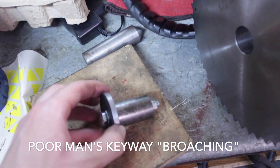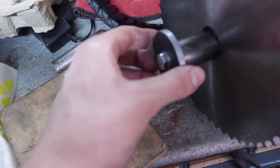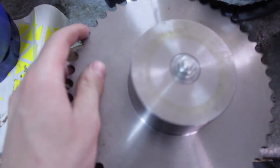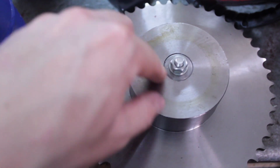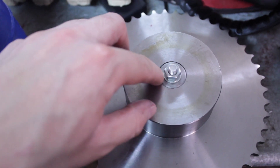I made this piece on the lathe and I'm going to put it here, tag weld here, and then put it in the drill press, center punch at the edge, and then drill it, and then finish the slot with a file. So let's see if it works.